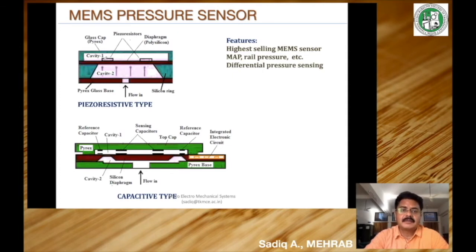For a line whose pressure is to be sensed, the line is connected to this cavity. Because of this construction, two cavities are formed: a top cavity between the diaphragm and the cap, and a bottom cavity between the base and the diaphragm. When pressurized fluid rushes into the chamber, the diaphragm deflects against the pressure of the fluid on the other side. The deflection is due to the difference in pressure between the two cavities — this is called differential pressure sensing.